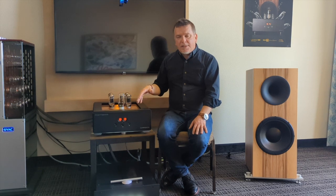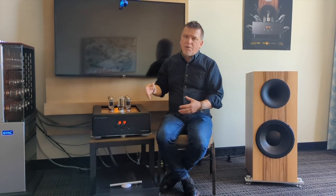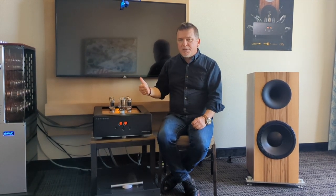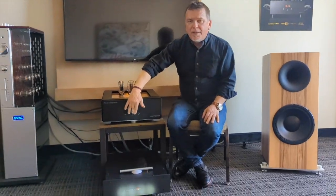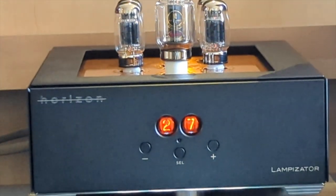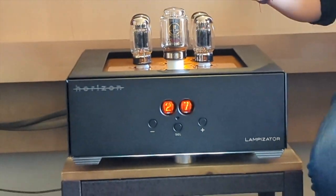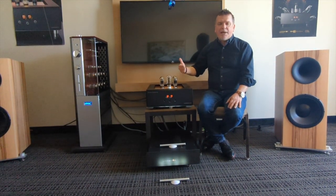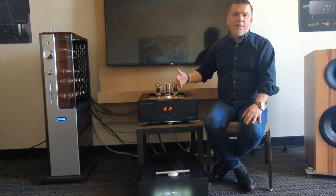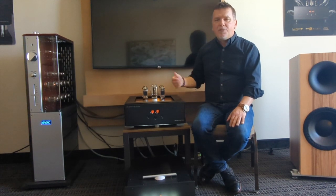So is this a preamp? No, it's a central point where you can link all your sources of music. So we have 8 inputs. By using the remote control or the input selection button, we are able to select 8 different inputs, of which the first 6 are digital. Number 1 is S/PDIF, the Sony Philips digital interface, which was born as a link between a CD player or CD transport without the full analog functionality. A CD transport feeding the DAC with an S/PDIF signal. That was the first link ever used in a DAC.